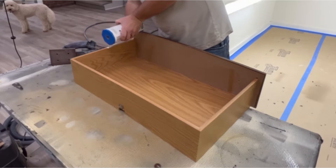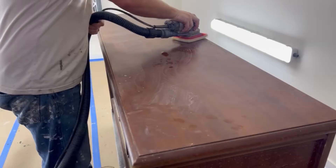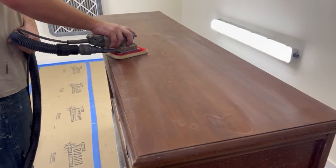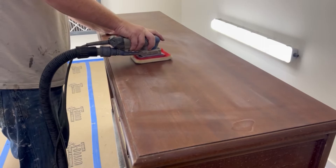One of the little things that make a big difference is that we always tape off the drawers. You don't want to see overspray on the inside or on the edges of the drawers — you want to keep nice clean lines. When scuff sanding and preparing for paint, you don't have to necessarily take all of the finish off. You just want to give it a good scuff up so primer can adhere to the existing finish.